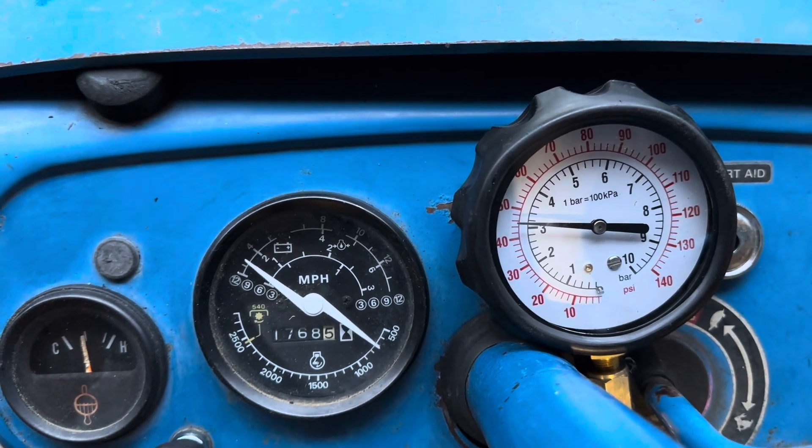I'm thinking we're all good. Those pressures look just fine to me, so it seems it is just the oil pressure sender tripping too soon, because the lowest pressure I saw was about 45 PSI at idle. The relief valve pressure is 35 to 57 PSI. Full bore, wide open throttle, it was running 72-ish PSI. I'm glad I did this just to know for sure. Now I will go ahead and order a new sender, but I'm not in a great rush, so I'm just going to put this machine back together with the old sender and ignore the light for a while. Within a few weeks, I'll have a new sender.